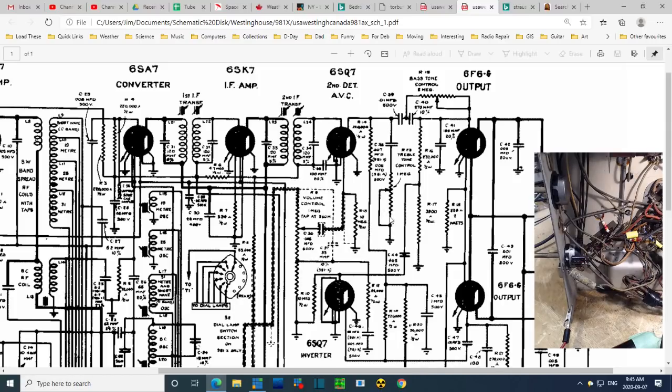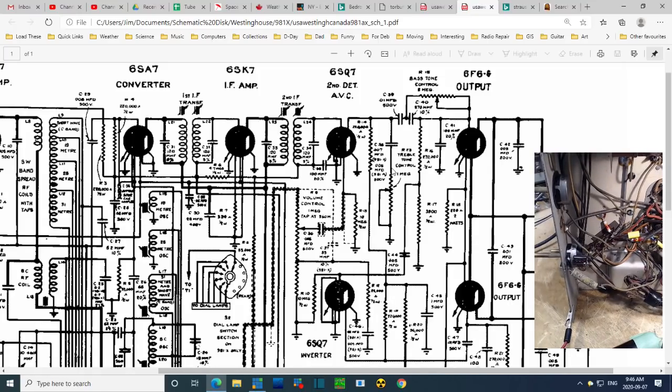What they've done is they've wired this as a series resistor. So essentially, this connection is missing right here. So instead of having a 1 meg load on this capacitor all the time, it's going way up and down. Is that certain? No, 1 meg all the time? No. When you move this control up here, it goes to zero. You could do the same thing with the way this control is wired now. You could dial it up to zero. But when you dial it the other way... I don't know, does that really make any difference how you wire this? It's not done the right way though.